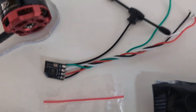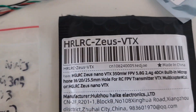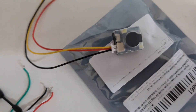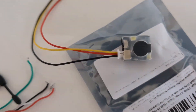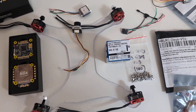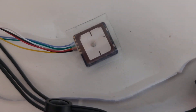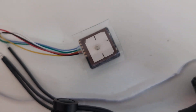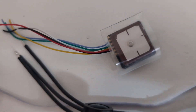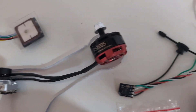Here's my all-faithful RP2 ELRS receiver from RadioMaster. For the VTX I'm using the Zeus VTX again — I'll chop it back to size to fit, the way I did with the previous build. Over here I've got the 100 decibel beepers I've recently gotten into that seem to work really well. So pulling it all together, those are all the components you need: frame, motors, bolts and nuts, and flight processor. At the top there is the GPS — I've gone for the non-mini one because they pull in more satellites faster, they've got an extra two leads for the magnetometer, and they're not much more expensive than the minis.